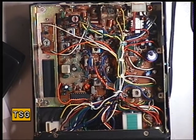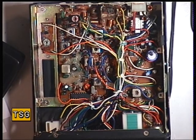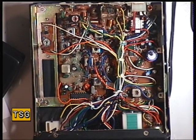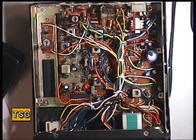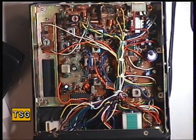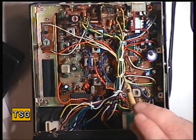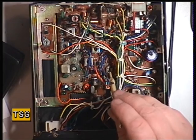And now it's time to look at the squelch. Switching the signal generator to the off position, setting the squelch to threshold, switching the generator back on - comes straight in. Switching the squelch to full on the radio and then seeing where that is on the generator. Unfortunately it never comes in, so we need to adjust the squelch preset - the squelch preset is RV101.